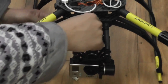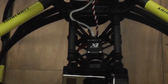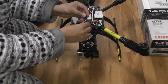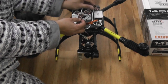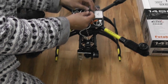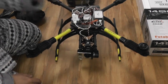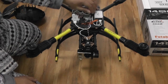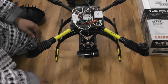Once the video is connected, the next thing to connect is the tilt control. There is a cable coming out from the port P, or pitch. This cable will simply go to another cable which is sitting idle and empty — this is the only one empty now. Making sure the polarity is right, connect it here and your gimbal tilt control will be on your radio. If you do not connect this cable, you cannot have the gimbal tilting down and up. So remember to connect this as well.